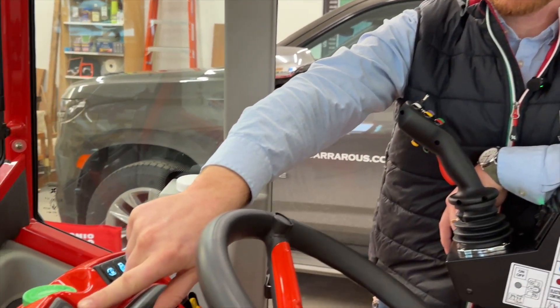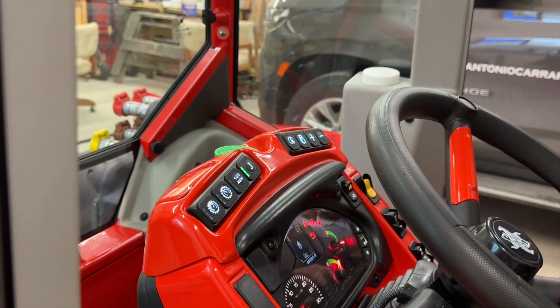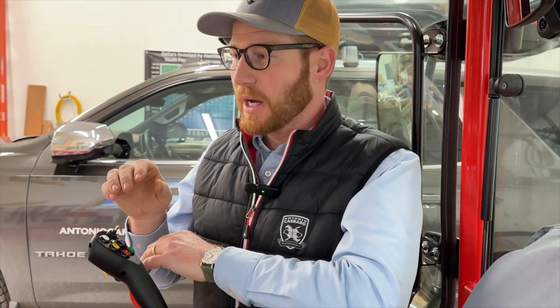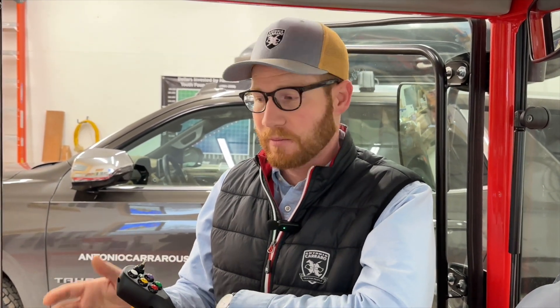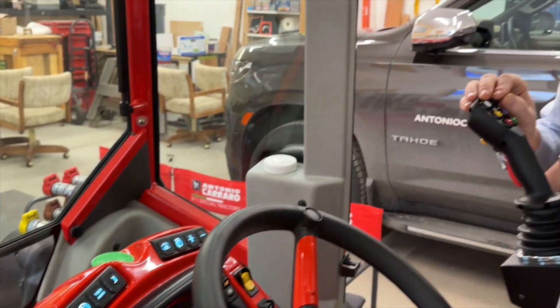It's easy. You've got a J button here — if you hold that down, you see your green lights and now your reverser is here on the joystick. So say you're in a rear-facing configuration because you want to be operating a forklift — now you have a really user-friendly, ergonomic solution. You've got your hydraulic remotes for top, tilt, lift, side shift — anything you want — available right here on the joystick, and you're also going forward and back. It's a really nice, easy-to-use platform for running a forklift. When you're heading down the road and want the reverser off the joystick and back to the main controls, just hold down the joystick button again — the light goes out, and if you move the switch, nothing happens.